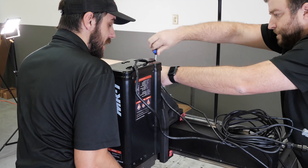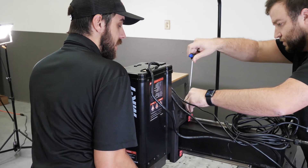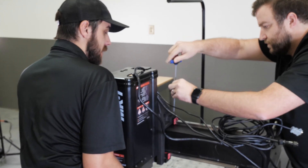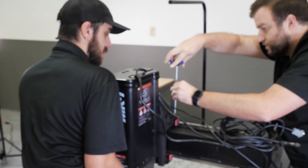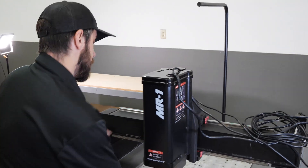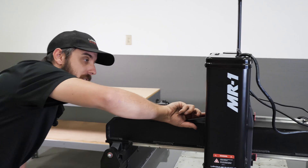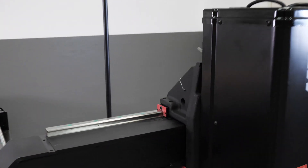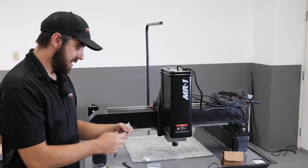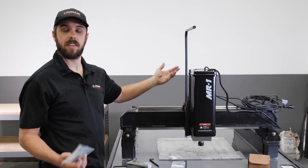While he puts the bolts in, I'm pushing into the bearings to clamp those shims into position. They really only need to get one bolt into each bearing at this phase, and then those two bolts will hold this up. Before I put the lower bolts in, I'm just going to check to make sure that I can't see any daylight at all between the bearing blocks and the carriage. That looks good, so now I can go forward and put all the bolts in and torque those down, then I'm ready to move on to the next step.